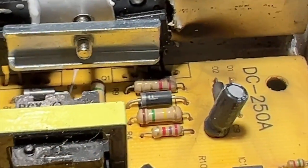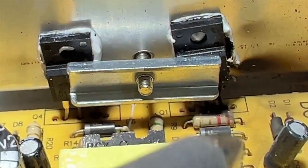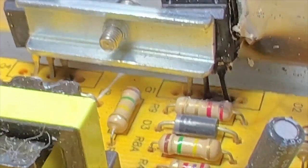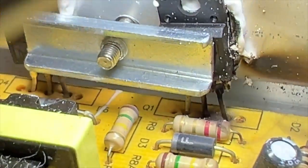The plot thickens. Next to the right transistor is a burn mark — that's generally not a good thing. And it looks like there's some smoke deposited on diode D2 and on resistor R9 as well. This needs a closer look. Yes, underneath that transistor, the printed circuit board is blackened with smoke.